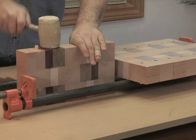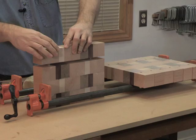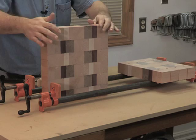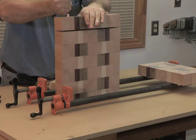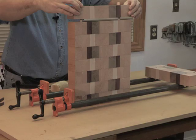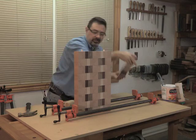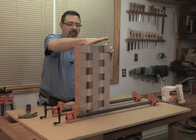Now we turn and close, turn and close. This is going to be hard to close because the dowels are so tight, so use a mallet — I'm watching my numbers: one, two, three, four. When I did that coffee table at 43 inches long, there's no way I could do that vertically, but you can put half of it together vertically and then the other half, and then just put them horizontal and start clamping, and that'll close up.